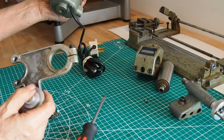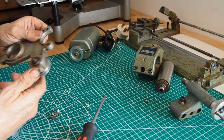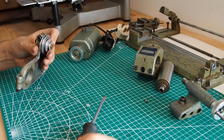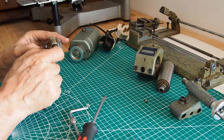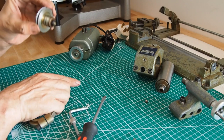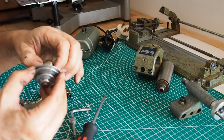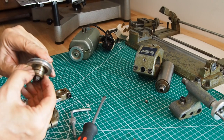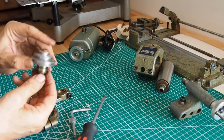Electric motor is off. We'll take that pulley off probably in the next episode. There's a pulley here — you need to loosen the allen bolt. This one has a bearing on it. It doesn't feel particularly smooth; it's quite tight, so it will benefit from being replaced. It looks like there are two bearings and it's a bit rusty, so we'll disassemble all that in the next episode.